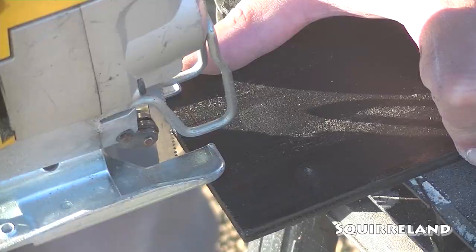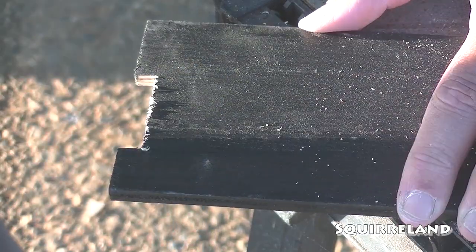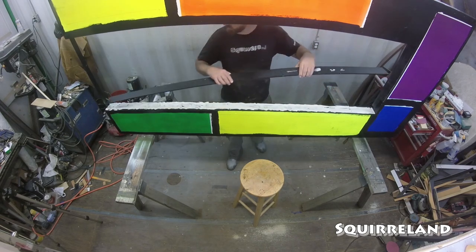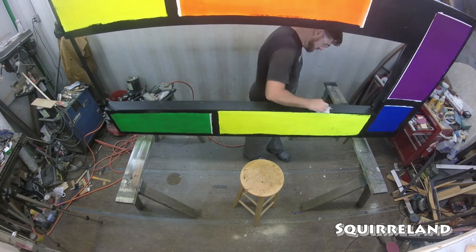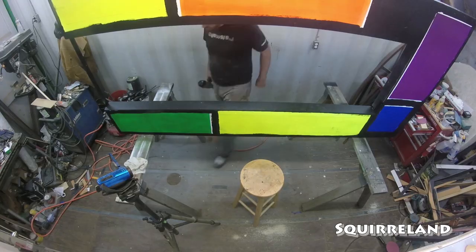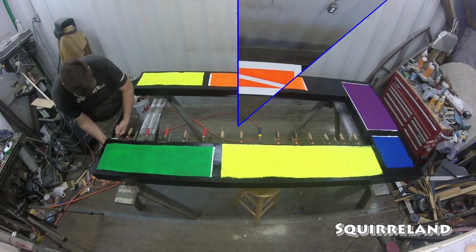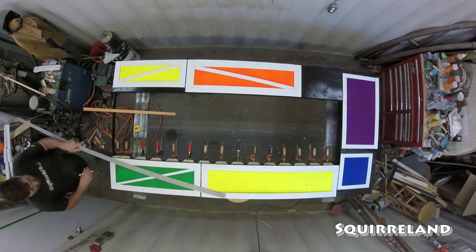Because the frame for this panel was rebuilt from an unfinished door panel, I assumed I had originally made everything the same size as the door panel I had recently made. Unfortunately, I neglected to check my measurements and there was a bit of a large gap on one side of the door. Not to worry — I can easily fill that space in with a strip of one-quarter inch plywood. While the glue for the door spacer dries, I'm going to finish cutting and painting the missing trim boards that I wasn't able to finish back when it was raining.